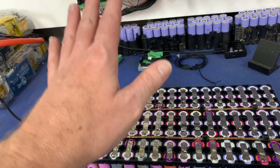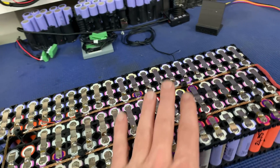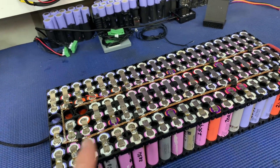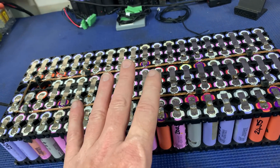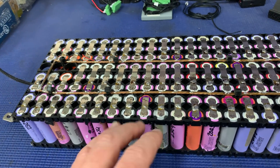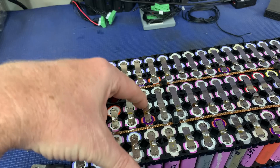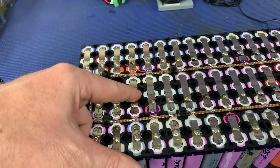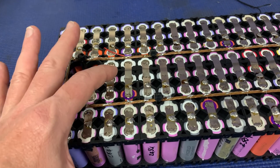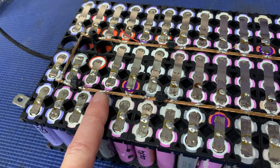Back at the workshop again, and I absolutely can't believe how dry it is out there. Instead of playing any games with this I just brought it straight home, got straight into it, grabbed the thermal camera this time, and tested the voltage — it was 0.02 of a volt lower than when I tested it on site, which isn't concerning since it was actively being charged at that point, not a rested voltage. I can feel there's something in this general area that is a problem. One drawback to nickel strips is it's a lot harder to see temperature differences on the thermal camera due to the shiny surface — you may need to cover it with black tape.